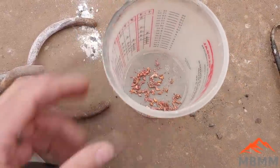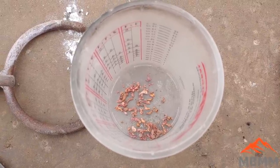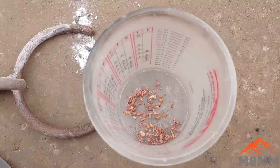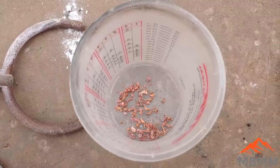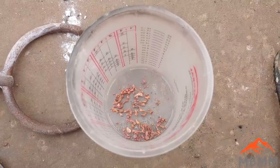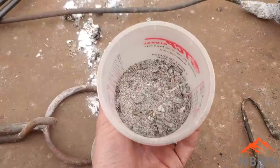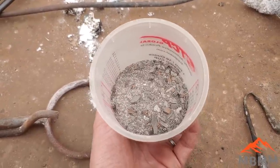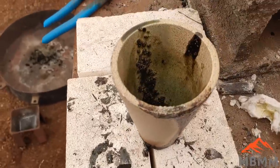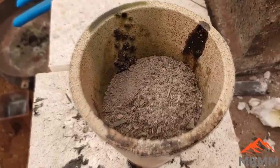This is some copper I made years ago — I melted copper down and poured it into cold water and made these little beads, like cornflake copper. I'm going to use about 10 to 15 grams of copper as a collector. I'll smelt a sample down, then take our copper collector metal, mix it with about 100 grams of lead, and try to cupel the lead and copper away to leave the platinum. Test number two: same amount of flux, same amount of catalytic converter, with 10 grams of copper as a collector. We'll repeat the process and see how copper does.